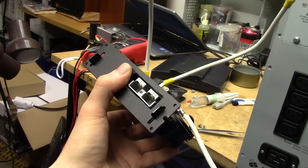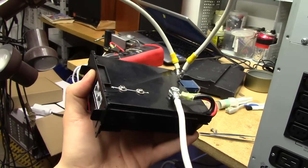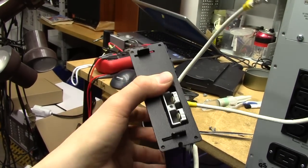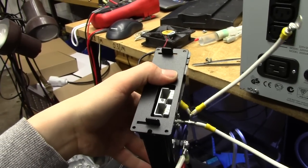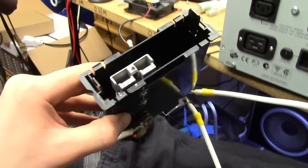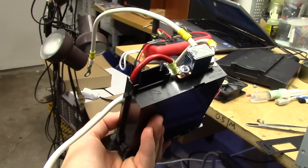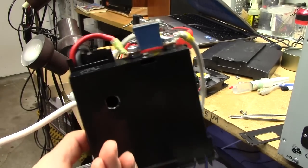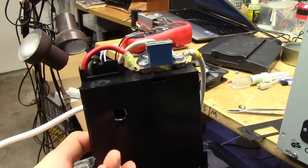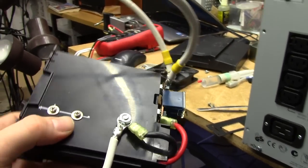And some rough cutting, grinding, crimping and soldering later, we've got this little external battery connection module. So all I've done is cut a hole in the rear back plate, mounted the Anderson connector as intended, drawn the cables out where the original smart slot connector would go, and I mounted a new 100 amp APC fuse on the back, which is just attached by running some screws in from the inside of the box.